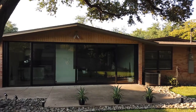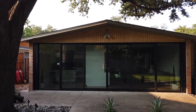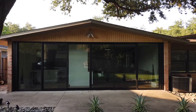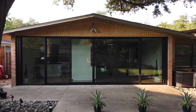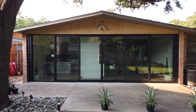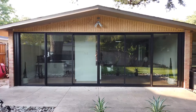The project has been completed. What we've got here is a four-panel Milgard thermal brake aluminum sliding door with two picture windows on each side. The customer originally had an old steel sliding door from when the home was built in the 50s, with single-pane glass framing. Because it was single-pane, in winter the windows and door would sweat, causing the steel door to rust and creating water stain problems. We knocked the whole thing out and put in a new header above the door.